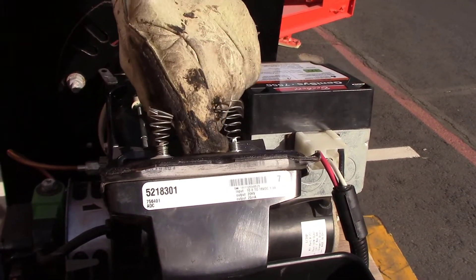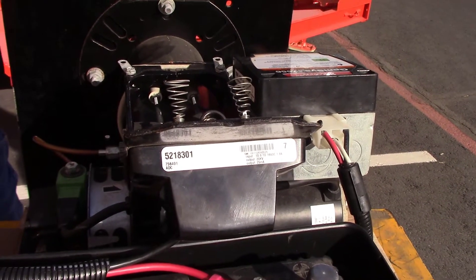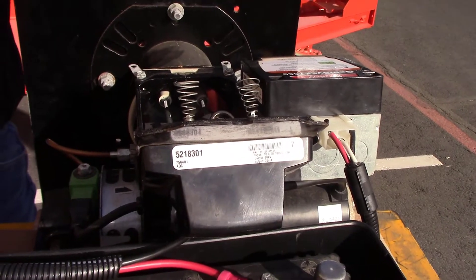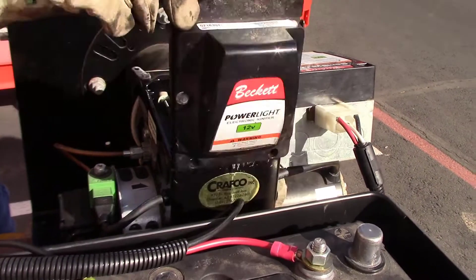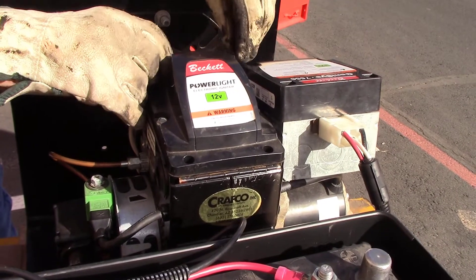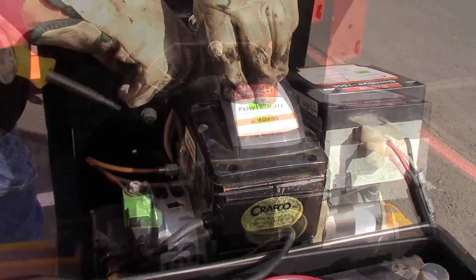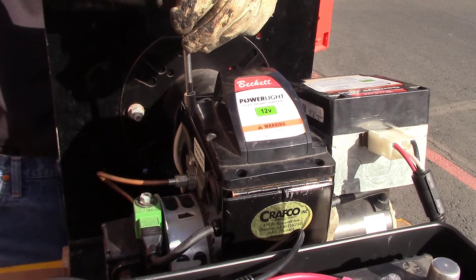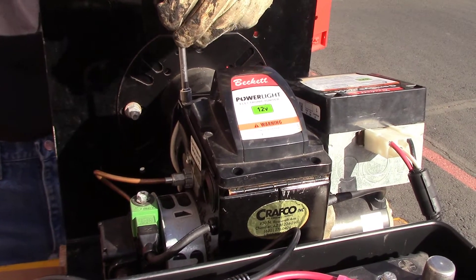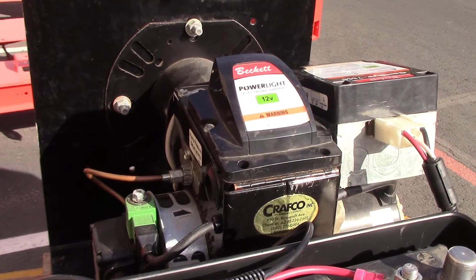If you're just cleaning it, you can plug it right back in and then close the module up, making sure that the tabs are pulled back into place and your screws are locked back down. You'll need to make sure these are locked down tight — this allows those springs to make contact with the igniter and ensures you're getting full spark down to your igniter.